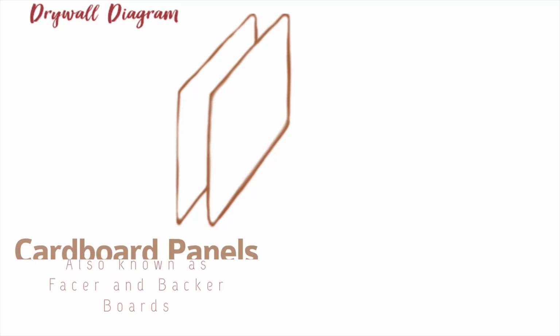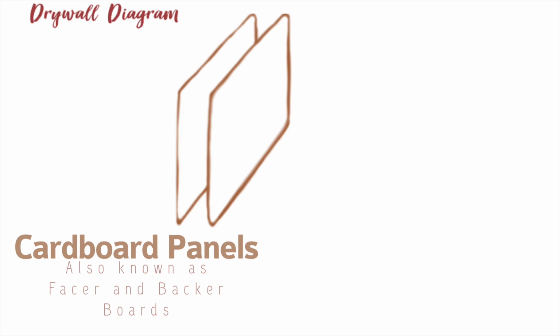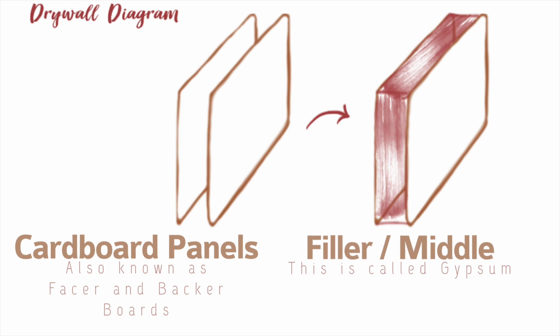Something I absolutely have to explain before I show you the rest of the video is what drywall is made of and how I will be cutting it to fill the medicine cabinet hole. So drywall is made up of 3 parts. The first 2 are known as the facer and backer boards. This is the cardboard that surrounds the filler in the middle that is called gypsum. That's that crumbly white material that I am cutting through in just a moment.